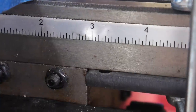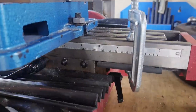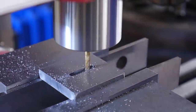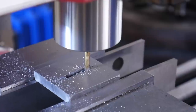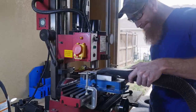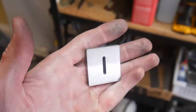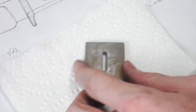You also saw me use a plunge cutting technique that I picked up from Carl Anderson. If you guys have any other recommendations on how to do this, I'm all ears — all the machinist guys out there, I'd love to hear your technique. Carl Anderson's technique was excellent and got the job done; it just took a little bit of time, and my mill isn't really set up very well for plunge cutting with that very weak torsion arm — I need to upgrade it to an air system eventually.